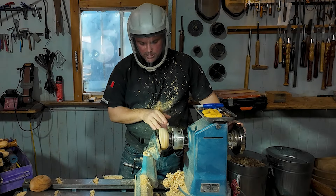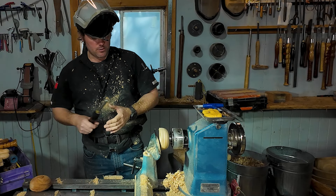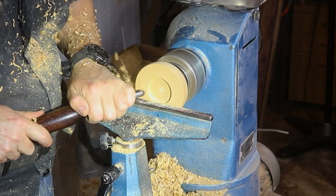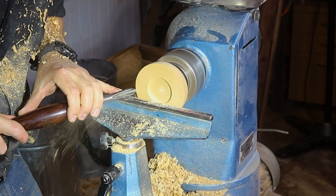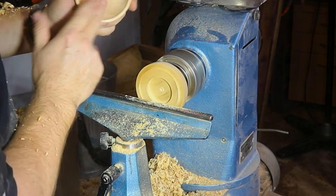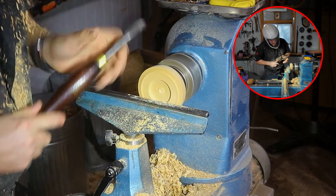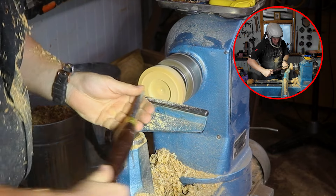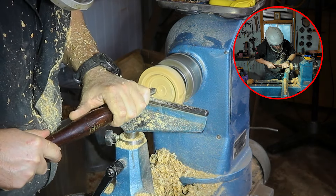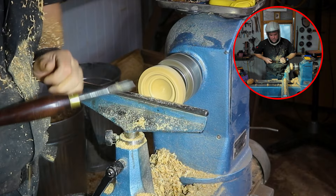Now we're ready to rock and roll on the inside. The first thing we're going to do is - because as we're pulling that tool around doing the pull cut we will rip material off the top - first thing we want to do is clean that top up and take that mortise down so it's a little bit safer. Come back, make a clean cut like so. I'll show you this method first and then the other method after. Make sure we're cutting on center, take the mortise down like that, start in the center, slow the lathe down.